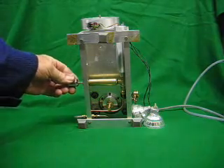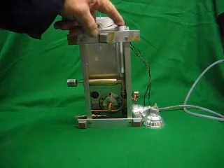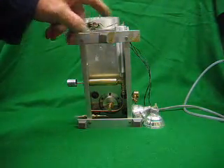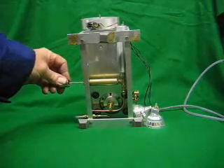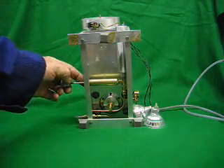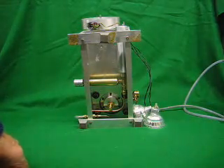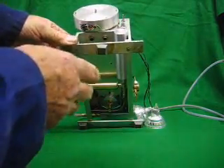This little pump here. This canister here contains silica gel desiccant crystals. The problem with pressurising a Stirling cycle engine is you do suffer with condensation inside the engine if you don't take the moisture out of it, which would cause corrosion problems inside the engine. So that is the underside of it.